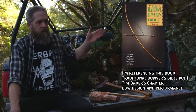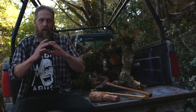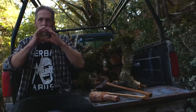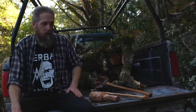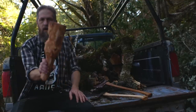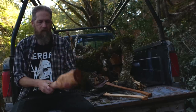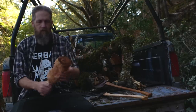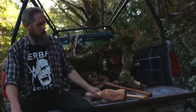If I don't seal the ends they're going to crack. I need to get these down to a smaller dimension — the smallest I can get away with for what I want to make. The thinner a piece of wood is, the less stress develops as it's drying and the less likely it is to check. My maul got chewed up real bad just doing that little bit — it's completely green and I'm hitting steel with it, so it's no small wonder. But I'll keep it around until it becomes not useful anymore.